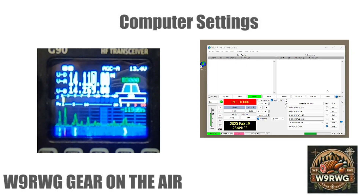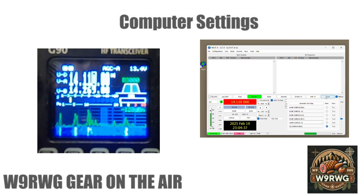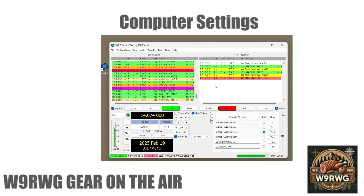Press the TUNE button on WSJT-X and observe the TX display on your radio. Adjust the power output setting in WSJT-X until the ALC — automatic level control — reading reaches 100 and the transmit TX power displayed on the radio screen is at full output.